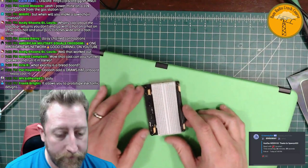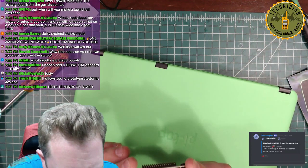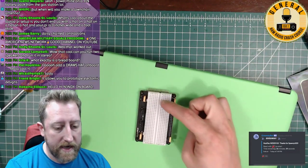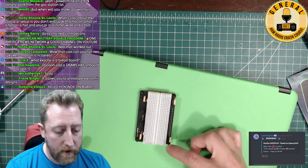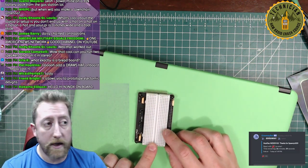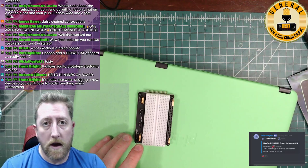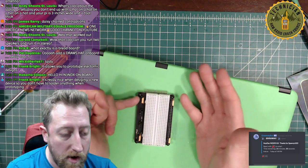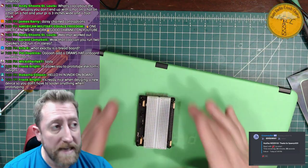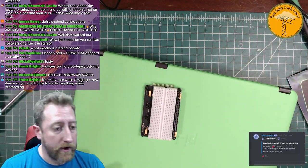So this is a breadboard. How this works, oh, this is a proto board. This is a bit different than a breadboard. But basically, you can take any kind of electronic component and you can connect it in these horizontal lines, and they go, one through however many numbers down. There's usually some kind of middle connector, and this middle slot is just wide enough for you to take an integrated circuit, an IC, and connect that down the middle. And then each of those legs of an IC, you can connect wire jumpers, resistors, capacitors, whatever you wanted to do. And usually on the outer edge is where your positive and return lines, your negative lines, go. So you basically will create your circuit by just plugging in little wires on the breadboard for whatever you wanted to do.